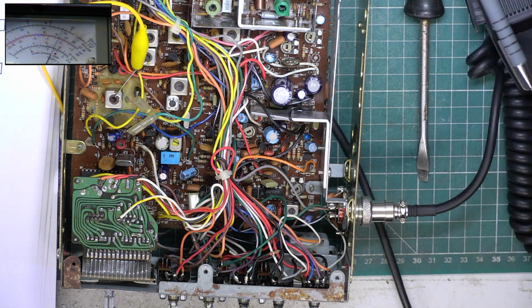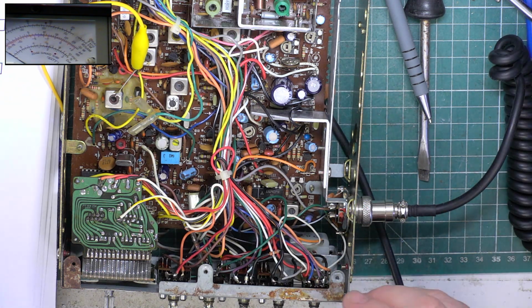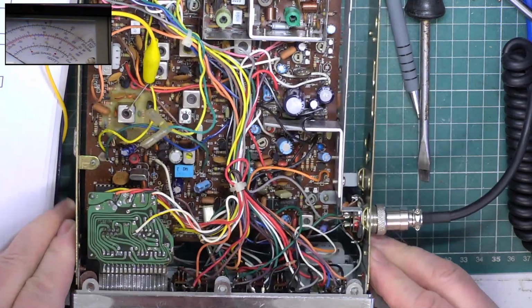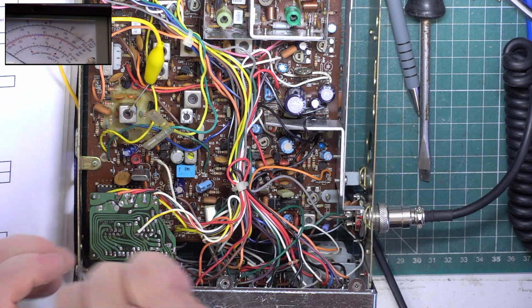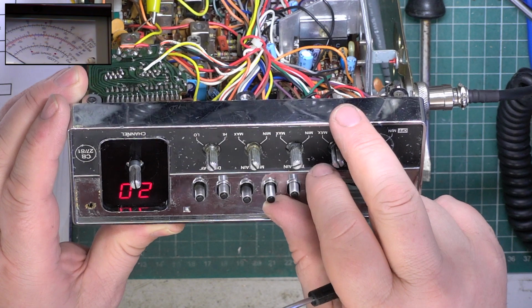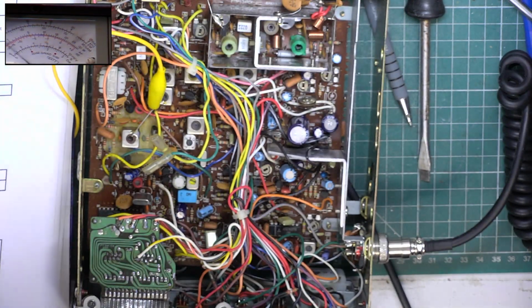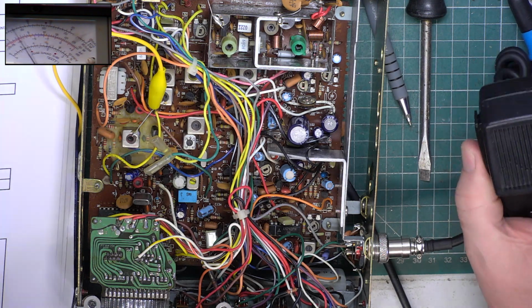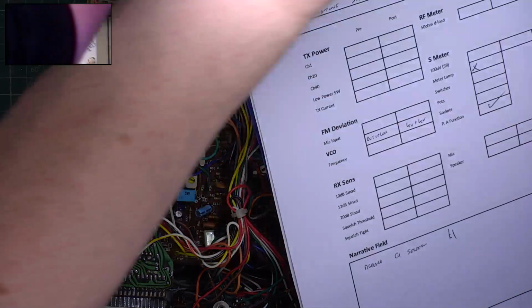So we're on channel 20, we'll go into transmit. Of course I've no idea where all these switches are, you know. I'll tell you what, I'll put this on with a couple of screws. It's probably in low power. So, tone, PA, transmit power. No, that's PA. That must be transmit power. That's better. So it's doing more than 3 watts. It's going to the 30 watt scale on the test set. It's doing 3.7. Take Alan's clip away.